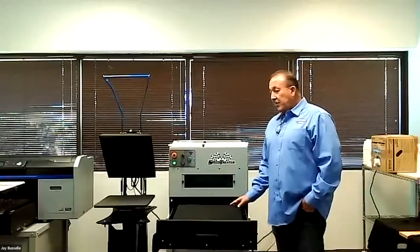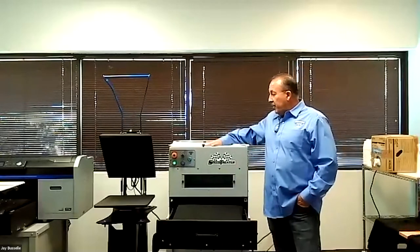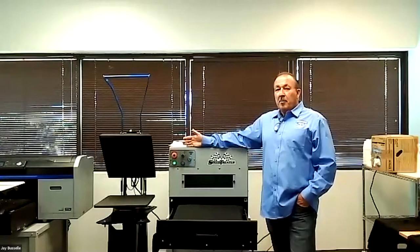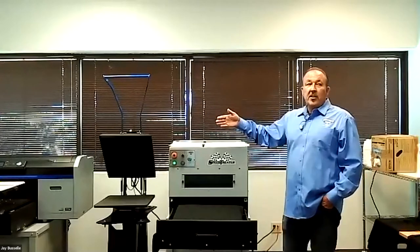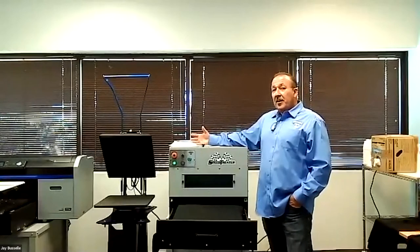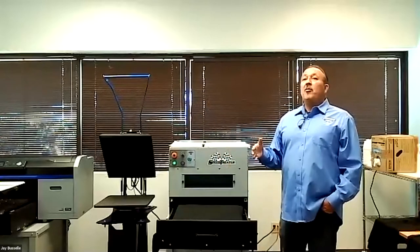What makes the difference between a great machine, a good machine, and a poor machine? The best machine is one that has a single sprayer with enough pressure to get a single pass on the shirt and where you can control the amount of solution. If your sprayer sprays on the way back and then coming forward, there can be pressure changes when that sprayer changes direction in the hoses. Usually that's because the pump doesn't have enough pressure due to the way they design the machine.